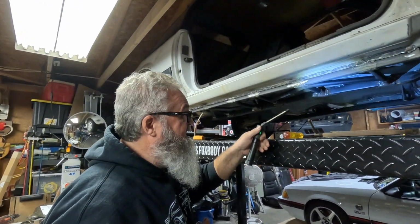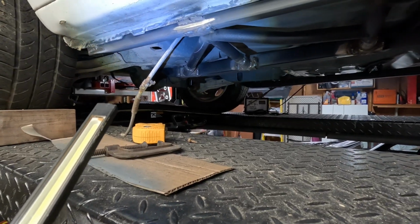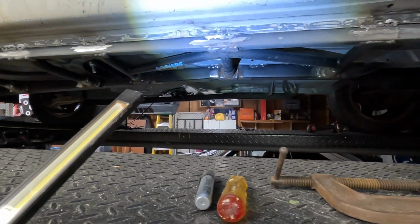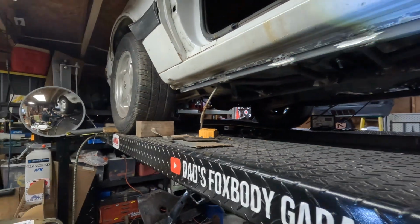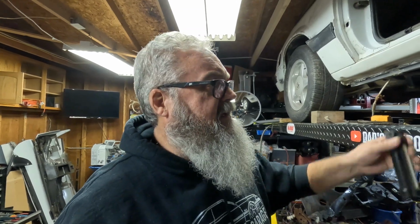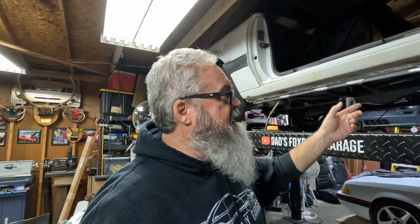Alright guys, so got her welded in. Let me get a different view here and show you. I'm not a professional welder, so please don't crucify me on my welds, but they are burned in, and until you've tried this, you know, don't cast stones, right? I mean, it's not the kit, it's the welding of different thicknesses of steel, 40-year-old steel, that crap's falling out of the pinch weld while you're welding. The knuckle portions of the system are a lot thicker than your subframe.